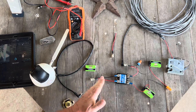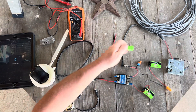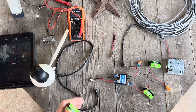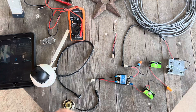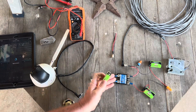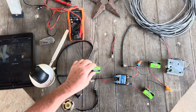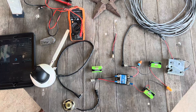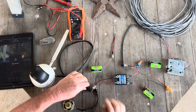With nothing connected — camera not connected to your relay — we've got the latch and the batteries all hooked up. So we're just testing from here to the latch. We're just going to touch our power to the relay and watch our latch pop. So that's an easy way to test that. We'll go ahead and plug our camera into the relay.